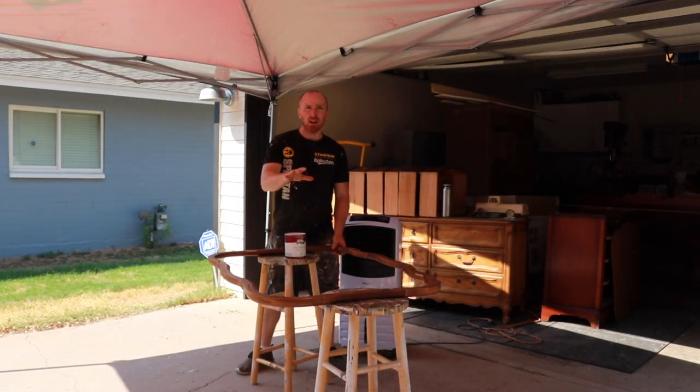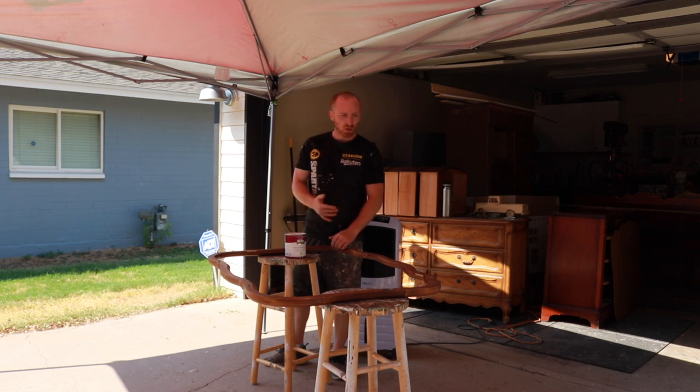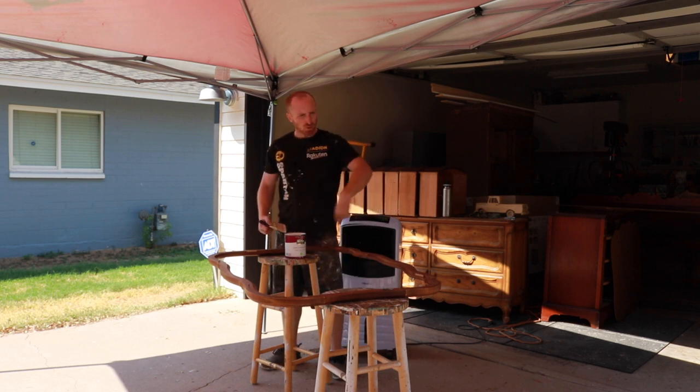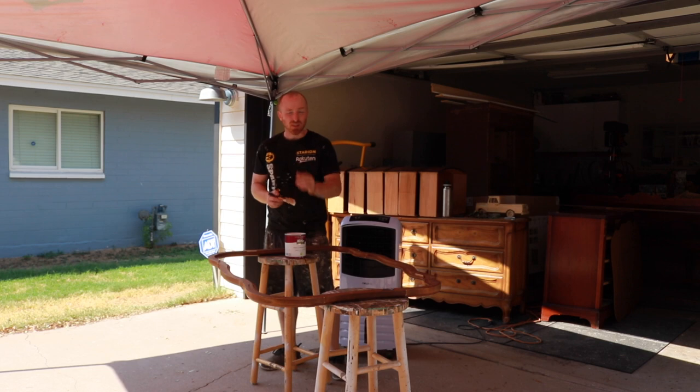All right, we sanded it down and wiped it off so it's nice and clean. We flipped it over so we can do this inner groove here. And this is what a lot of people forget to do. When they're painting a mirror, they just leave the mirror in and they paint. Well, what happens is that reflection shows the brown behind here and it makes it look cheaper or not as quality done. So what we do is we pull the mirrors out. It's a lot more work, but it's worth it. We're gonna paint this edge so the reflection will be of the white, which matches the frame. So one, two coats around this, we'll flip it over, and we'll do the other side with it. So let's get started.